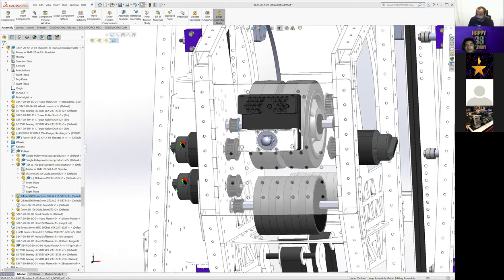That was never the ideal. That was never what we were planning to do. But we knew we needed to spin the 6-inch wheel, this is all from memory, somewhere closer to 5,000 to 6,000 RPM. Especially for a really deep shot, if we were trying to shoot from behind the color wheel control panel, which originally in the season was one of our largest goals, to be able to have a shot from beyond half court. Due to ball tolerances, ball wear and ball inconsistencies, we never got a consistent shot from there, and we never even tried it in competition because we didn't need it.